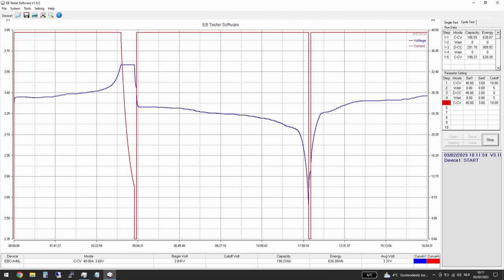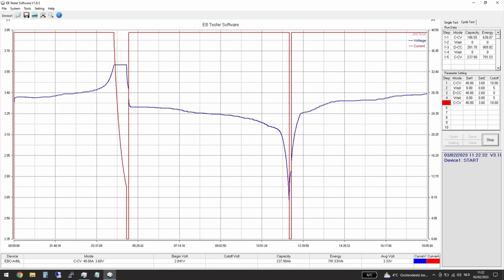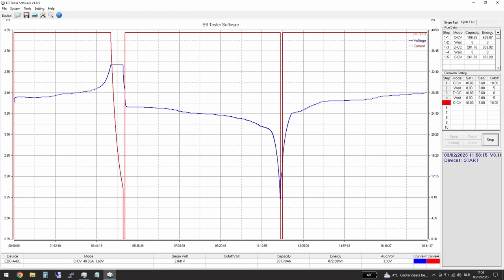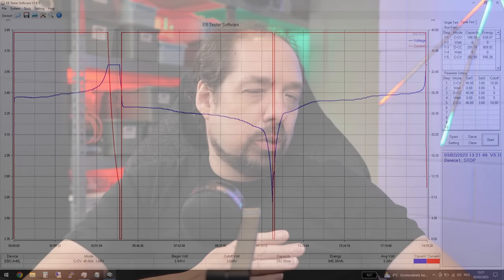After a quick wait, we start charging again. We see the same pattern — it quickly rises in voltage to about 3.3 volt and then only climbs slowly, right until the cell reaches saturation and then it spikes up. This is also the reason you don't really have to charge to 3.65 volts. You can charge to 3.6 or even 3.55 and then float charge the rest, so you don't have to use that high voltage, which in theory is better for the cell. Each battery chemistry has its own electrical properties, which is why you can parallel batteries with the same chemistry — it doesn't have to be the same amp-hours, but the same chemistry and behavior — and you should never mix multiple chemistries in a single setup.